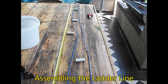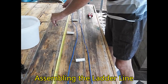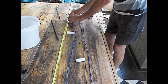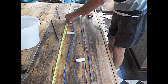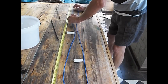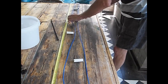Alright, here we go with the last few. We've got four more to go, and we'll just go ahead and run it out. We're about 30 centimeters apart. The spacing between the spacers isn't as critical as the spacing between the conductors — that's where I was trying to be careful with my measurements. Kind of got a rhythm going now.